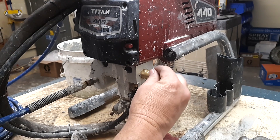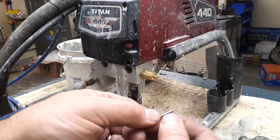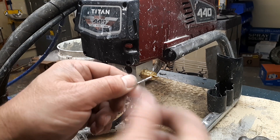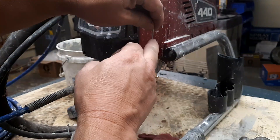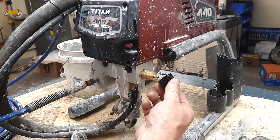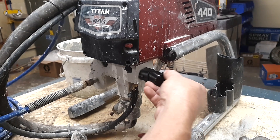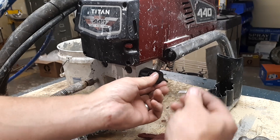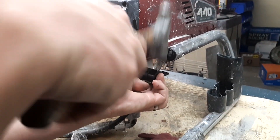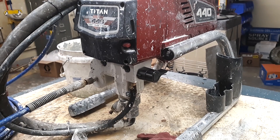Take your old pin, stick it in the hole, and turn it until it's vertical — straight up and down. Now your new pin and your old pin both have a ridge along one end; that ridge helps lock it in place so it doesn't fall out. When you put the new pin in, put the ridge up top and smooth end goes in first — if you try to go the other way it can be difficult and damage it. Put your collar on — the pin goes right in the hole so it doesn't spin. Put your new handle on — you see the hole — slide the pin into the hole, gently tap until you find alignment, then tap it all the way down. Don't go crazy hitting it because if you hit it too hard you'll crack it.